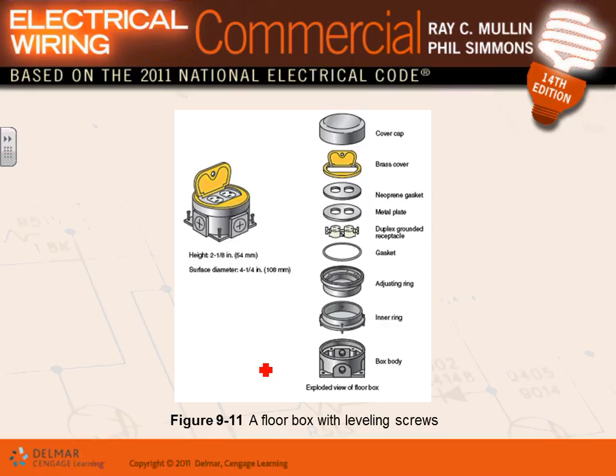Okay, here's a floor box with leveling screws. These are the fittings that you can use. You can bring a PVC conduit and attach it right here. And here's all the hardware that goes to build this receptacle in the concrete slab. There's adjustment, you can cut and adjust to make it flush with the floor. There's a cover for protection so nothing can get into it. Obviously, you can't flood it with water, because if you're washing the floor, you have to pay attention to putting water inside there, because these are face up in the concrete slab.